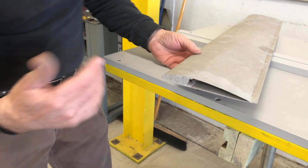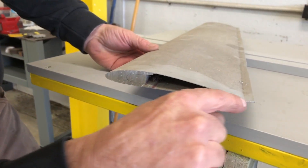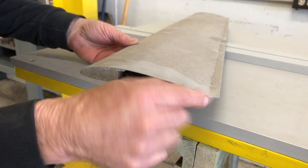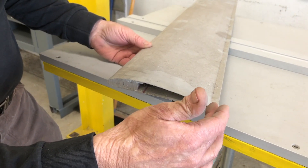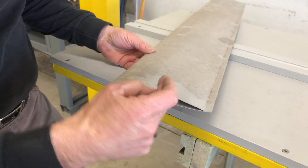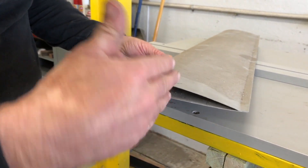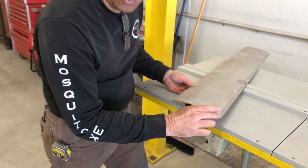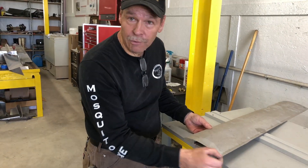The next roll form is going to bend a small reflex on the trailing edge of the blade. This is a specific angle it has to be at. As the blade flies through the air, you use the reflex to move your center of pressure either fore or aft on the blade so that it can be easily flown. Getting the right amount of reflex is an important thing, and that's what this next machine is going to do.